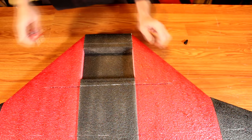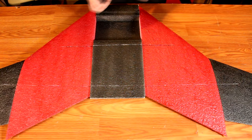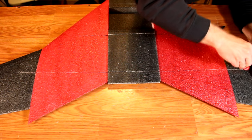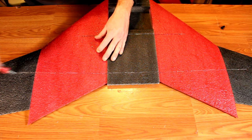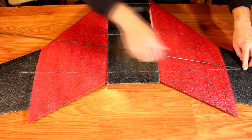Do the same with the front, the back, as well as the top and bottom. If you feel it was a little dry, add a little bit of glue over the top to be sure this spar doesn't move, as this will keep the wing stiff in high-speed maneuvers. Repeat this for both the front and the rear main spar.